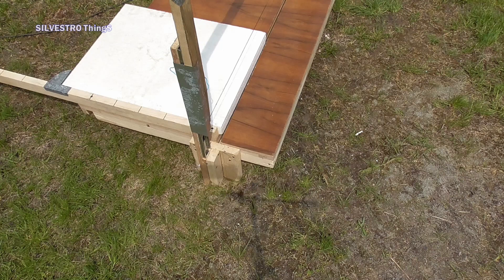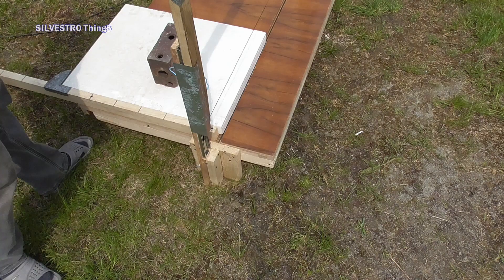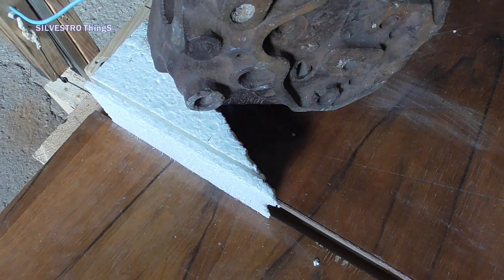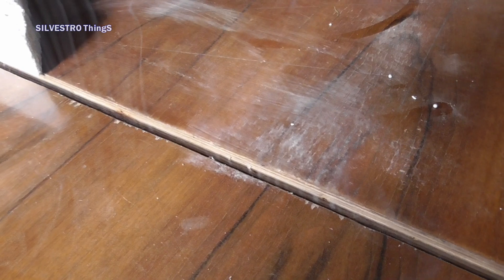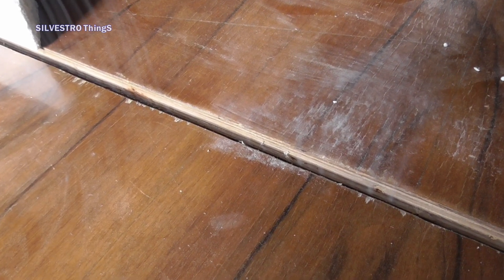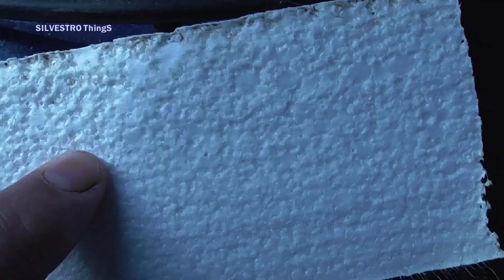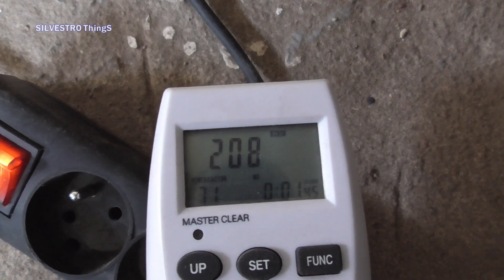For a perfect cut line, the lightweight polystyrene sheet must be secured by a weight against movement. The cutting wire must be heated to the appropriate temperature so that the cutting time is as short as possible and the cutting surface smooth. Using a wire that is too hot shortens the cutting time, but at the same time causes increased emission of harmful polystyrene fumes and the formation of a hard and brittle coating at the cutting side.